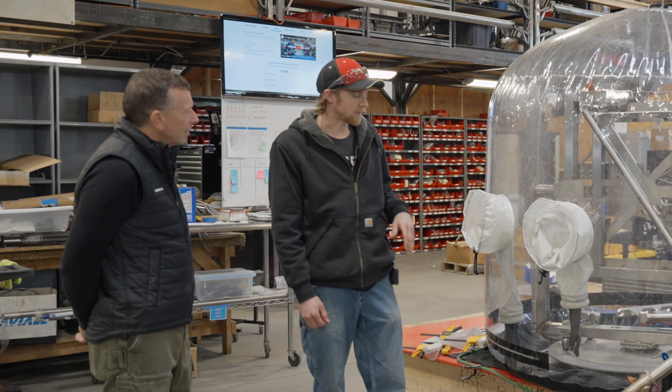The actual gear that came out is pretty cool. The tubes are a little beefier than the original, which looks really neat with a 35-inch set of bush wheels on it — it just fits. It has that look that tells you it's ready for action. The whole point of this is saving weight, like everything we've done in titanium. We started making smaller parts in titanium, we went to the tail spring, and then we went to this. If you replace your gear with titanium, you save seven and a half pounds, including the step change as well from standard gear.